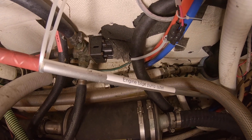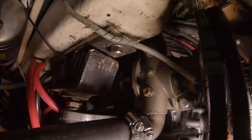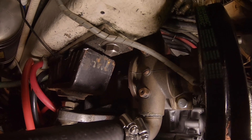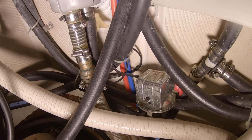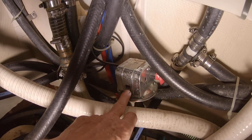As well as the electric pump, Fair Isle has a mechanical pump that's driven off the engine by a couple of belts. There's a switch on the main control panel to turn it on and off, but it mustn't run dry — so it has a little contraption in-line that detects a vacuum and will switch it off automatically.